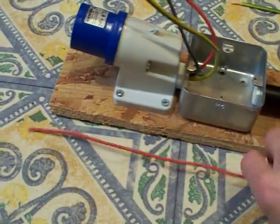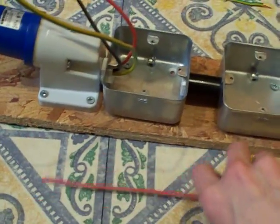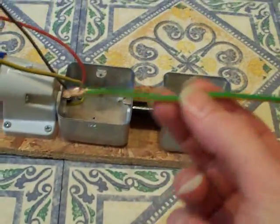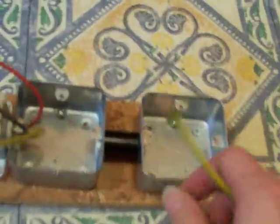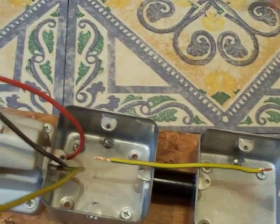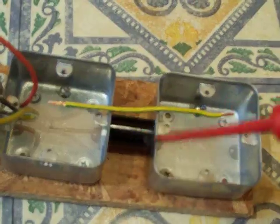I've measured these to length and snipped them off. Interestingly the off-cut is long enough to make another fun jiggery pokery unit from. I'm going to use that in a minute. I was preparing a little earth bonding strap at the point the battery warning came on. That strap goes between those two earth terminals — one there and one there — joining the two boxes up for earthing.